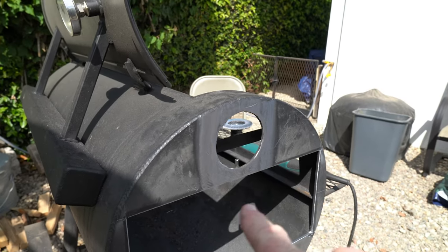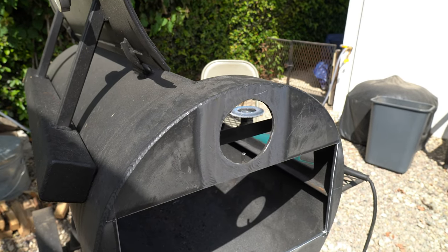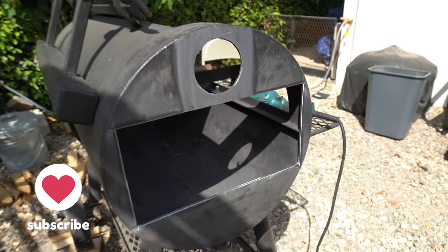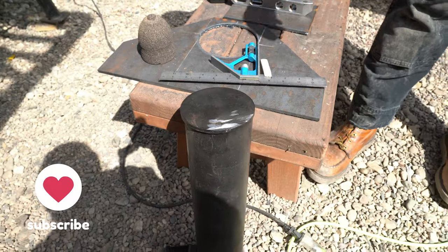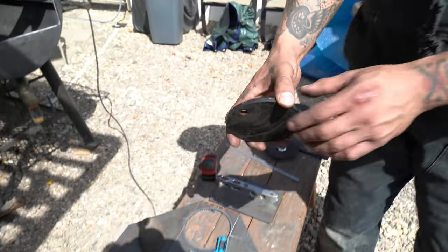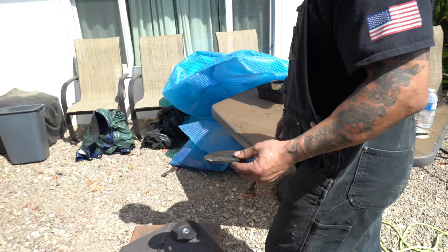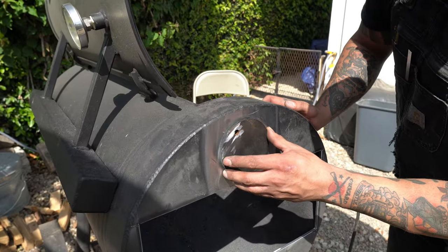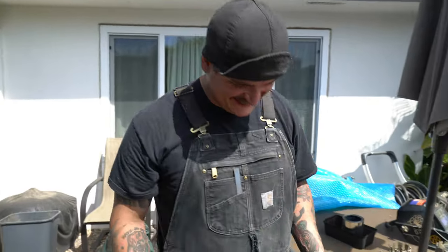You might be wondering what to do with that little four-inch exhaust stack - actually a three-and-a-half-inch hole that's left there. Instead of cutting out your own circle and hoping you're seeing straight, just take the rain cover, take off the rivet, and you've got a perfectly sized piece. With just a little bit of grinding - voila. Nathan, thanks for that great idea, man. I never would have thought about that.